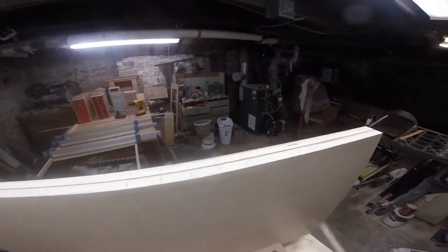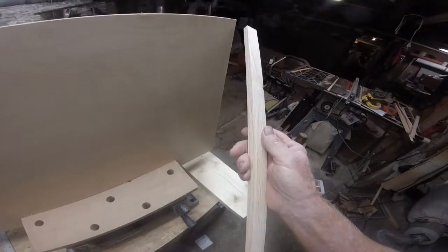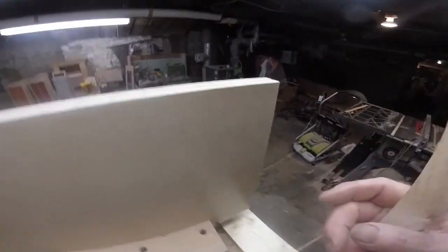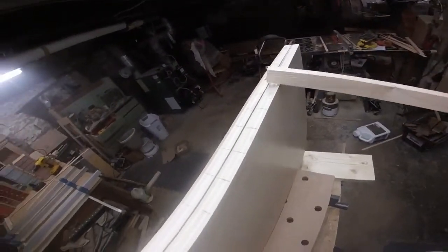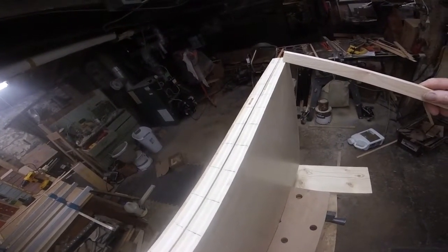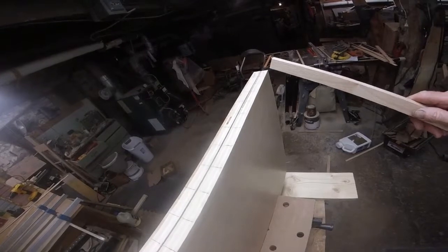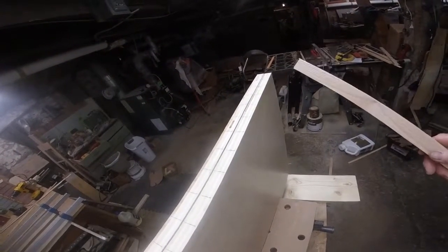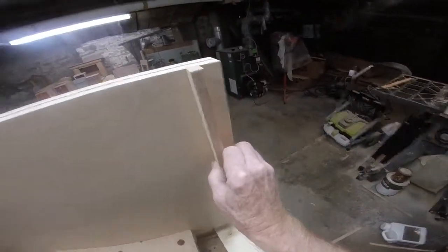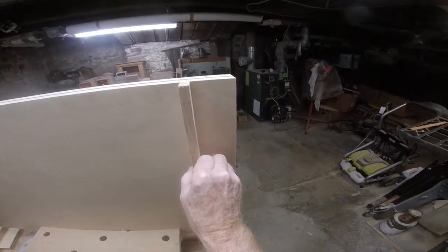Now I'm going to be using 1 inch by 1/2 inch thick runners. And what I do, as you can see, I've marked each one, and it's 1.5 inches. I want 1 inch between so that the puzzle cabinets can slide in. The puzzle cabinets are 1/2 inch thick, so I want another 1/2 inch so they don't get stuck. All right, so this is 1.5 inches, and when these runners get put on, it'll be like that, and so you'll have 1 inch between each one.